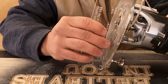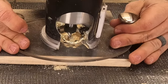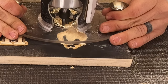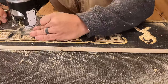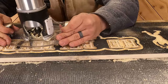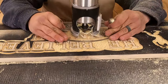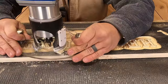The next bit I'm using is the 90-degree bit at between 3/16 and a quarter of an inch. As I drop into the Sasquatch — where the arms and feet are — it gets really tight, so don't feel like you have to go full depth and risk nicking the sides of your carving. All you have to do is make sure you get that wood low enough that you won't have a high spot once you spray and sand. When making the cloud around your lettering, for new carvers especially, draw yourself a line to follow. For me, it took a long time before I didn't need to draw a line — it takes just a couple extra seconds and really helps, especially when you're first starting. Also make sure you get in between all the letters like the H, B, and O, because it's easy to finish all your carving, spray and sand, and realize you forgot to cut out a few of those pieces.